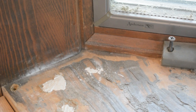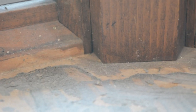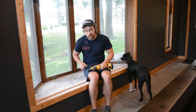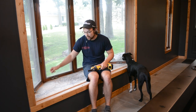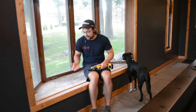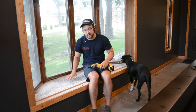I was then investigating the piece of wood that the bench is going to be sitting on and realized that it goes underneath the windows and underneath all of the trim, so I had to figure out how to get this out of there without damaging anything else. I ended up going to my oscillating tool for that. Because of the way that this board was installed, I'm going to have to cut around the perimeter to remove it. Ideally I would just put a board over top of this, but because of the mechanism used to open and close the windows, I wouldn't be able to put the bench in here. It might take a little while, but I think that's the only option, so I'm going to use my oscillating tool to go ahead and do that.